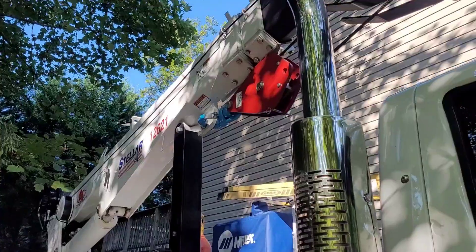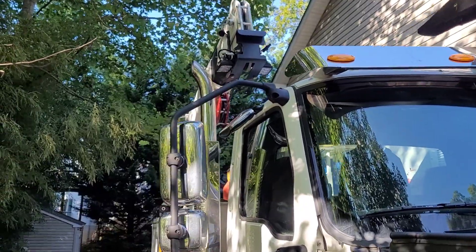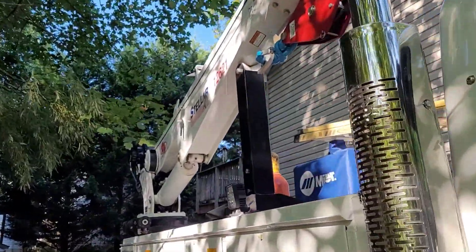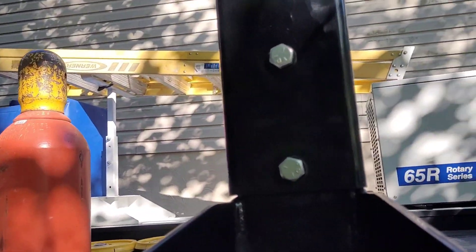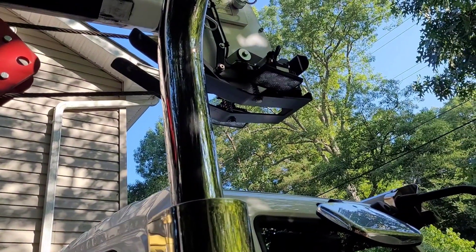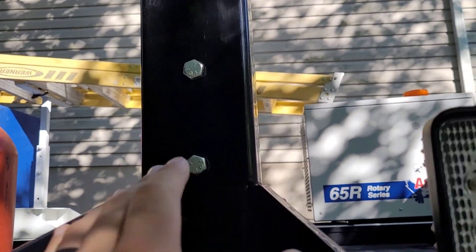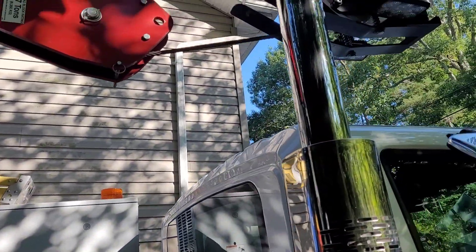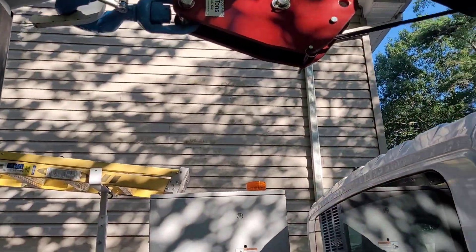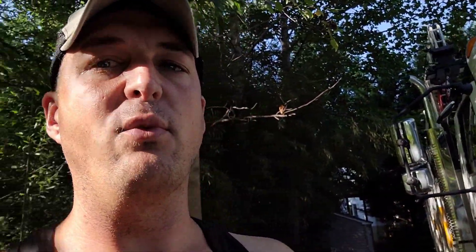When we first set these trucks up, we were trying to get this crane to be at a somewhat decent height. When we first had the trucks set up, they were pretty much at the highest notching point we could get so the crane wouldn't activate the limit switch right there. Me and good buddy Josh spent some good time figuring out how to get it down to the lowest level, and we finally figured it out by a certain amount of reach so it wouldn't hit the limit switch. We're no longer going down the road clipping trees, and we don't have to worry too much about overall height restrictions like we did before.